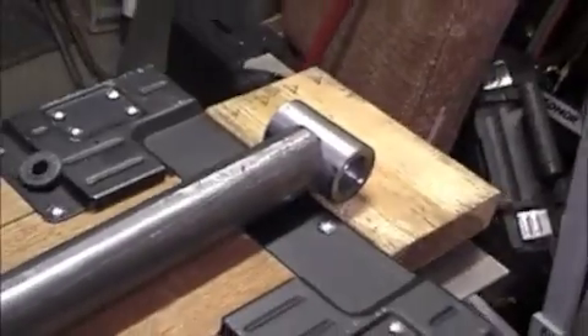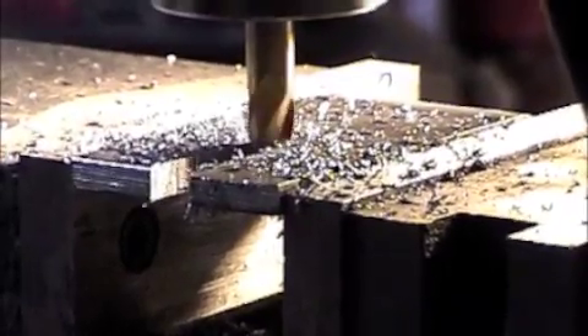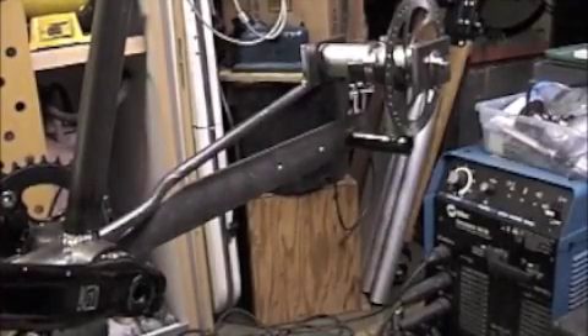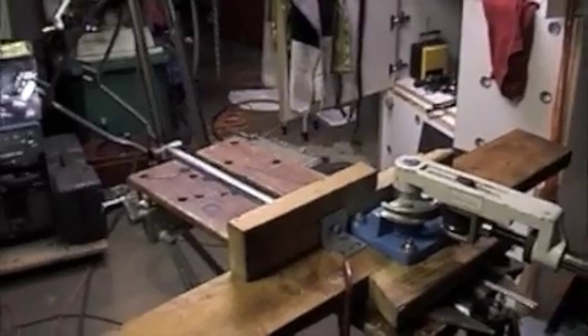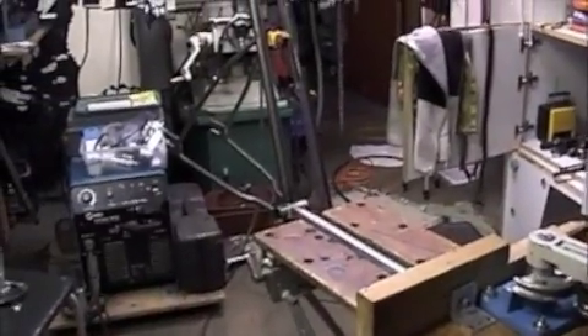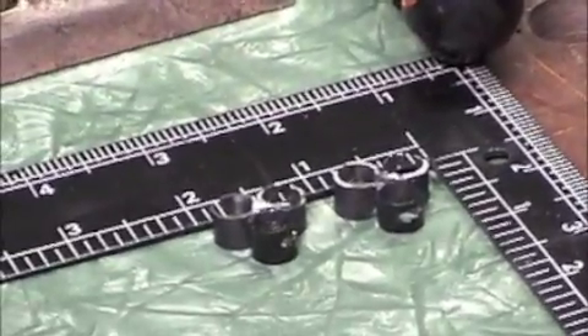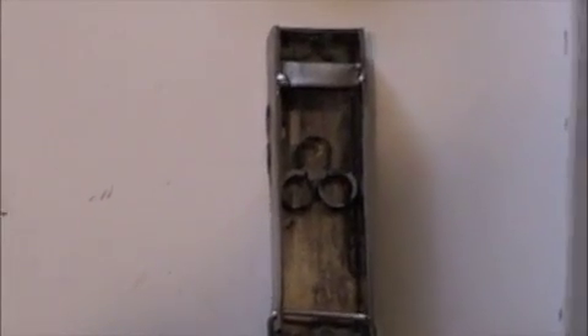I machined the side plates of the NuVinci out of quarter-inch steel, then attached those to a mock-up with a very simple jig for the rear hub. After that, I weld on the half-inch tubing to the center section and replace that. Then I make a splitter for the brakes — as these vehicles are pretty heavy, you want really good brakes. The splitter is three-eighths steel, and I make the case out of stainless, then attach it to the back of the machine.